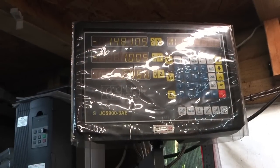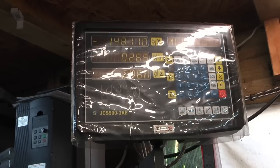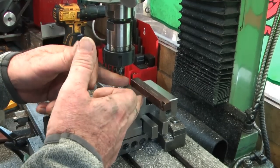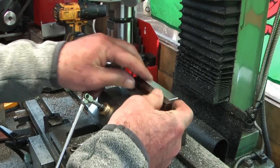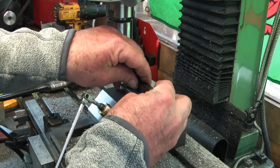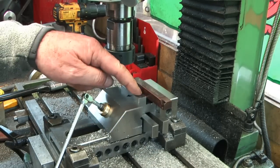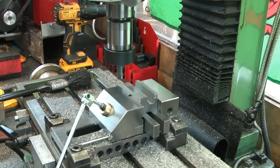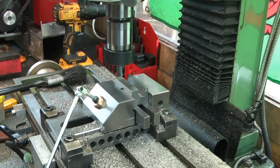That's a quite nice finish on that back wall. Let's offset the other way 0.2mm - back the other way, climb cut again on this front face, then we'll have a measure. I'm going to go to 1mm offset the other way. As it turned out, that wall thickness was 6.1mm, so I've just taken 1.1mm off the back face - it's literally size for size but it doesn't fit. So I'm going to take 0.1mm off the top now - that'll be a 1.1mm offset in both directions.